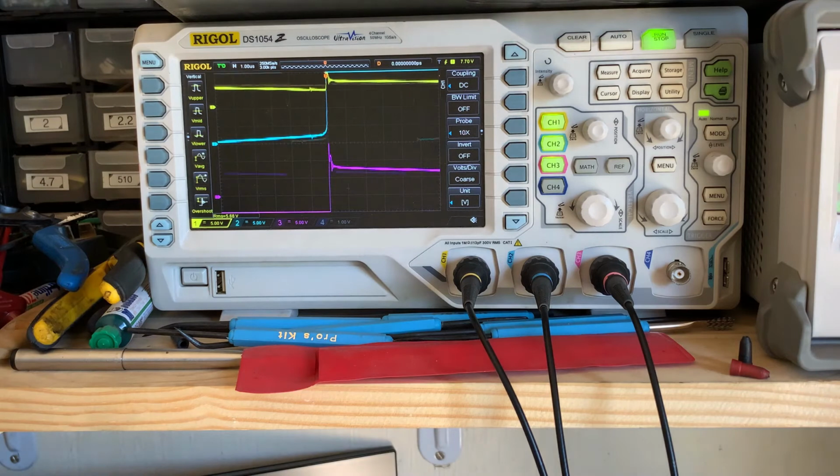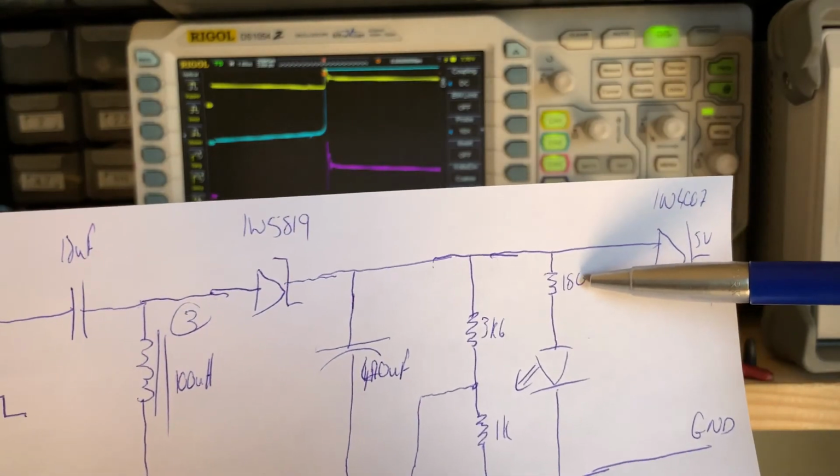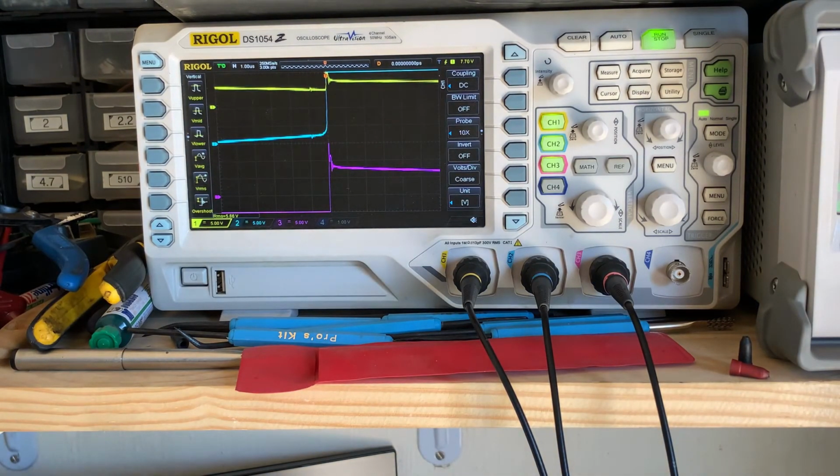At 15 volts we're pulling 18 milliamps, and let's do a little efficiency calculation. On our output, the only load that we have is this 180 ohm resistor. So we have 5.7 divided by 180 ohms, which is 31 milliamps. We square that and multiply by 180, so we have 180.5 milliwatts of power that we're drawing. On our input side we're putting in 270, so we divide that by 270 times 100, giving 66.852% efficiency.